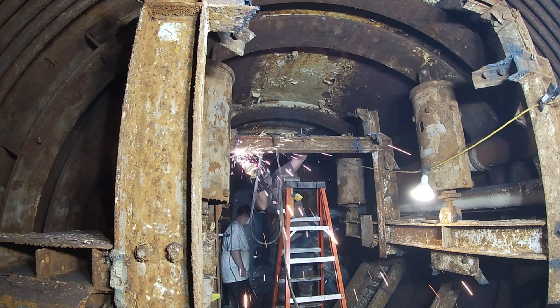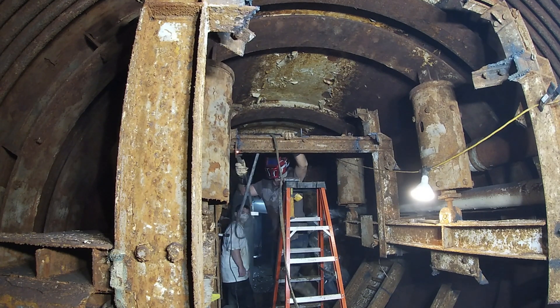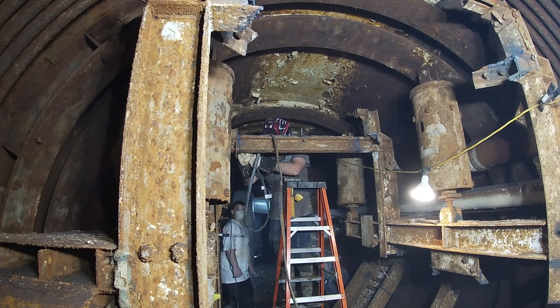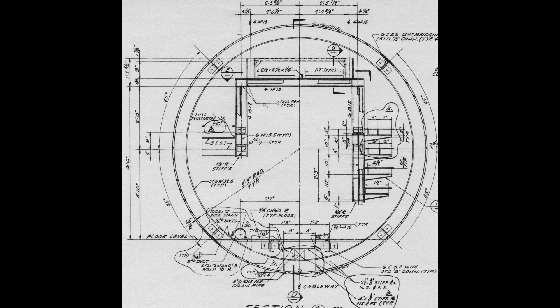What you can see here is the basic structure of our cable ways — this is where all the I-beams are. You can see just how slow it is; he's just cutting a little corner of an I-beam and it takes forever. I have a plan to take these out in about five to seven hundred pound chunks as opposed to breaking it up into small pieces. There's really only one piece of I-beam that connects the two sides, and some angle iron in an X pattern between the frames, which is relatively easy.